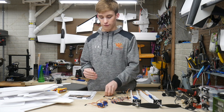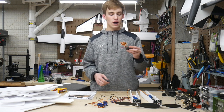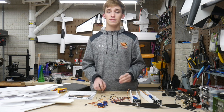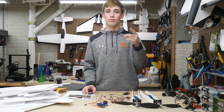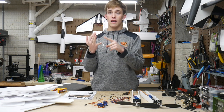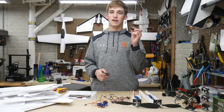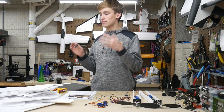I've also got four push rods and four control horns for the surfaces. For the receiver, I was going to use the RadioMaster R88 8-channel receiver — these are brand new and run off the FrSky D8 protocol, very nice receivers. However, I haven't really tested them yet, so I'm going to stick to what I know: a genuine Spektrum AR610. That's only a 6-channel receiver, so if you do the math — two throttles, two ailerons, cargo door, elevator, and rudder — that's seven channels, which is too much. So I need to pick up a Y harness, or I could just use the 8-channel and have one extra channel to spare, but I'm going to stick to what I know to avoid any weird brownout issues after putting so much time into this build.